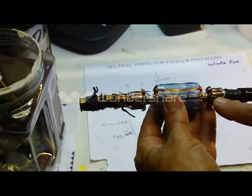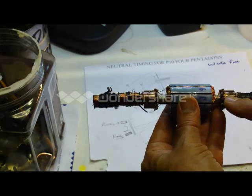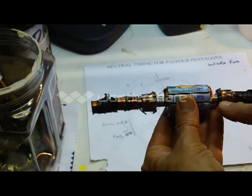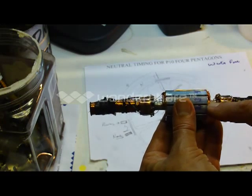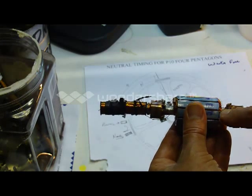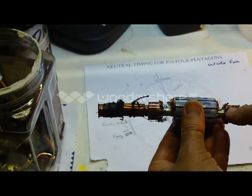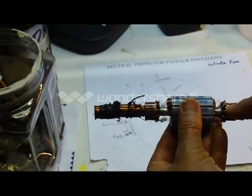I think I made one design mistake on this so far. I think I have a little too big of a gap here between my commutators. I had no way of knowing exactly how far out this wire would stick, and I erred a little bit too much on the long side.